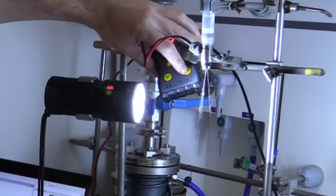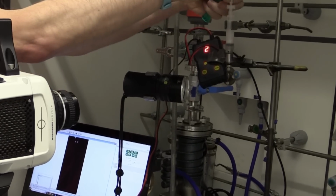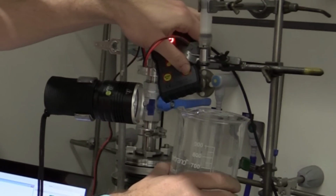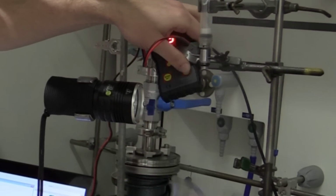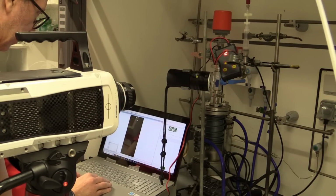Okay, so we have some sort of partial blockage on the nozzles. So previously when I've had this, I flushed a load of cleaning liquid through it, which is basically detergent and water, and that seemed to do the job. So I'm going to do that again, see if that sorts my problem out. Right, let's see what this does for us. Oh, there you go. Instant unclogging. We're back. So this is just a really quite powerful detergent and water. Pulses, that's nice. Oh God, they're hugely different, damn.